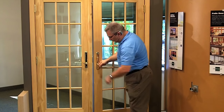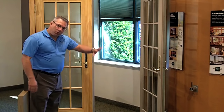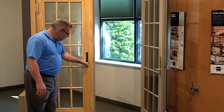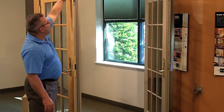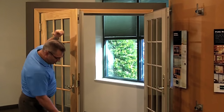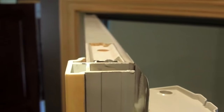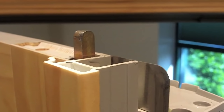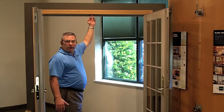When I unlock all of this and bring this open, all of that works great, but it depends on the locking system for the other side of the door. When we open this side, we're turning the handle, and that is driving — opening it will pull down a pin from the top and pull in a pin from the bottom. But when we lock it and raise it to lock it, it will put a pin that sticks out over one inch at the top and over one inch at the bottom, locking this panel into the threshold and into the header of the door system.